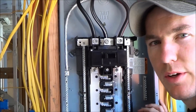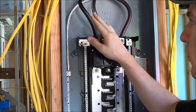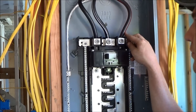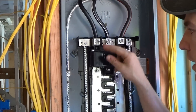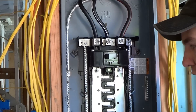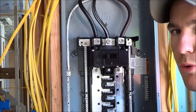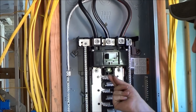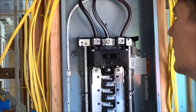We've got all of our aluminum conductors put in the panel. We've got our two that are 120 volts each — one leg that's black-black, one leg that's black with a red line, each at 120 volts. Then our black-white is going to be our neutral, our return path. Then we have our ground right here. We have our grounding strip where all the bare copper wires from our Romex are going to land. Our whites are going to land on these two strips on the sides, and our hots are going to be attached to the breaker on each one of these breaker buses.